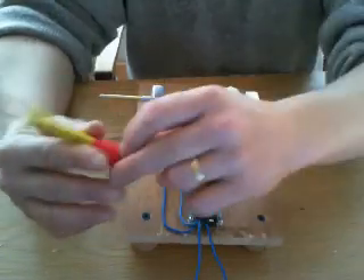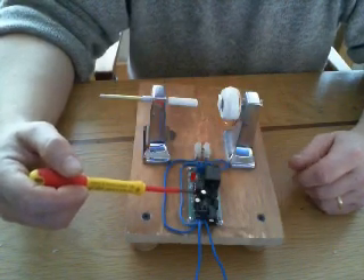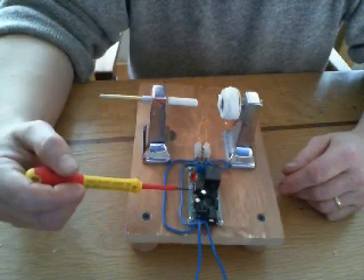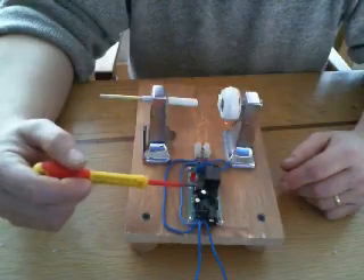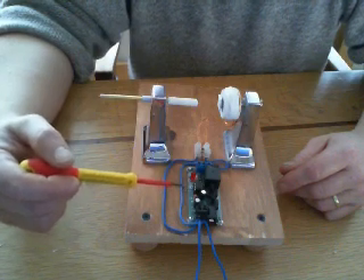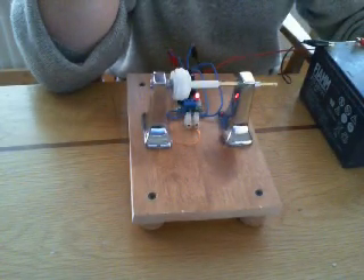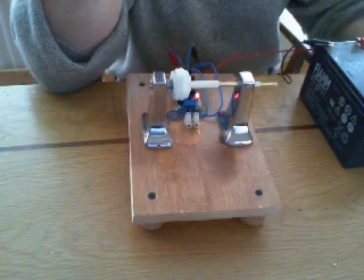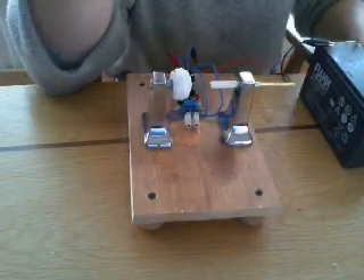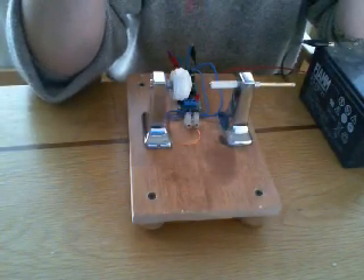This particular timer uses a 100-microfarad electrolytic capacitor as part of the timing circuit, and it's a bit big, so it switches quite slowly. I suppose I might swap that out for something smaller to get a greater frequency rate. Anyway, let's get this thing going and you can see it running. I've got this thing hooked up to a 12-volt battery. So there you are — we're doing exactly what Art said it would do, only pretty slowly, and as I said, that's because of the capacitor.